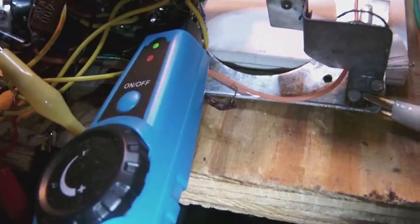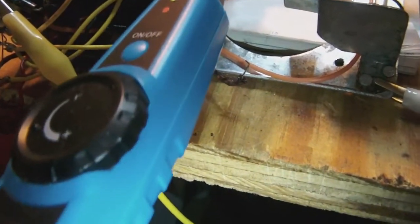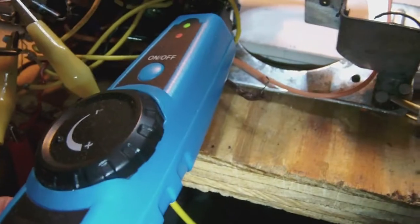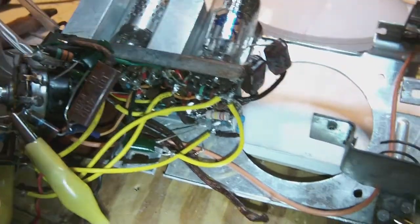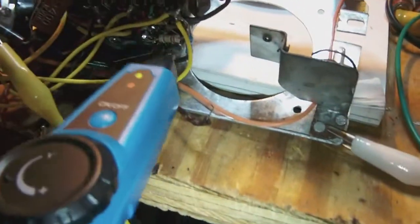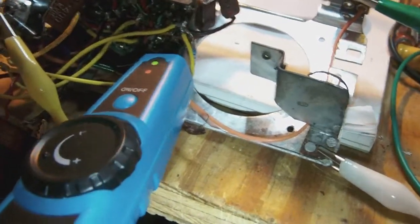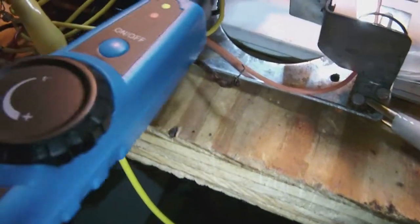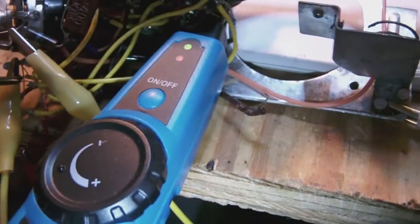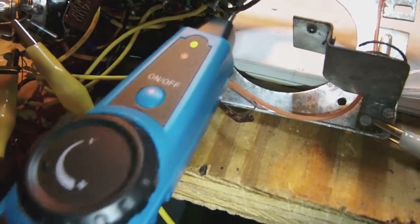Squealing, actually. It sounds as if it would be receiving something, but when I turn the tuning capacitor, I only get a sort of squealing out of the radio. And I'm not sure what the cause of the squealing could be. Also, in my opinion, the sound is a little bit weak, so I might have to investigate what is keeping